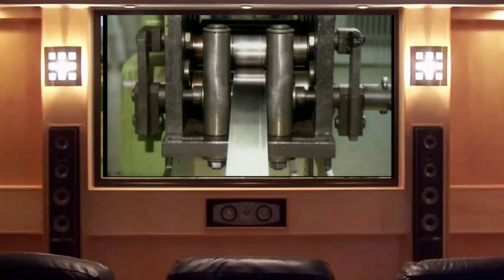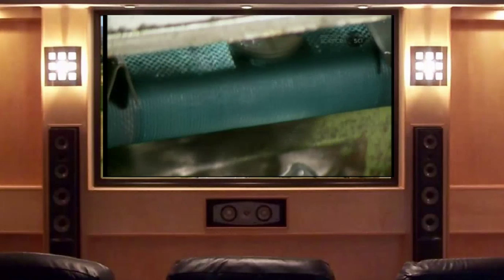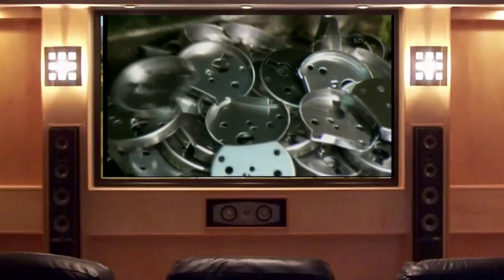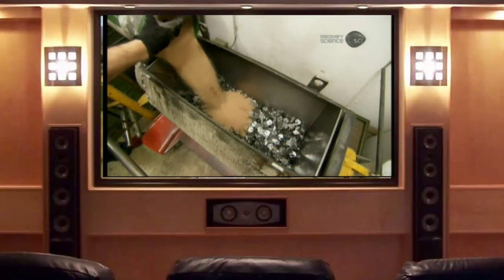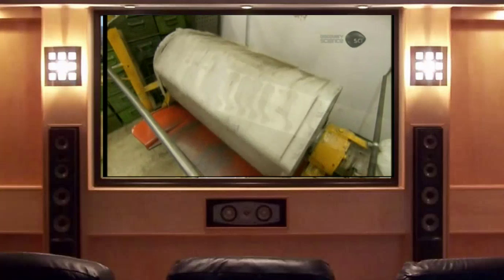To make the two halves of the lock body, they uncoil a narrow band of heavy steel. Rollers straighten it, then a punch press shapes and cuts out the part. Four punches produce a fully formed part. The front half includes the side flange, the keyhole, a post, and rivet holes. The parts tumble with wood chips, and the friction removes unwanted bits called burrs. The chips also absorb residual oil from punch pressing.